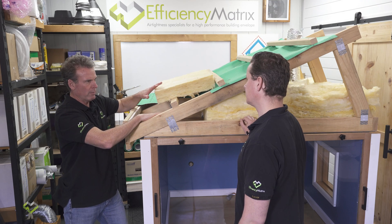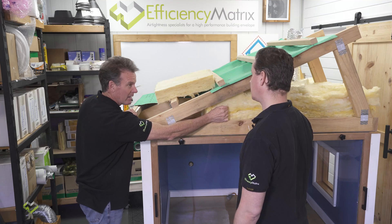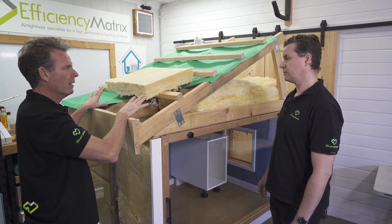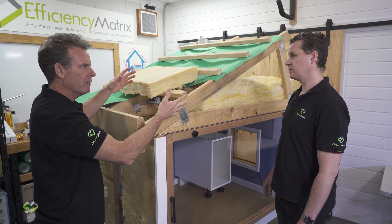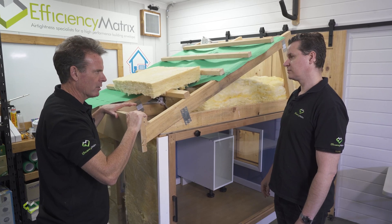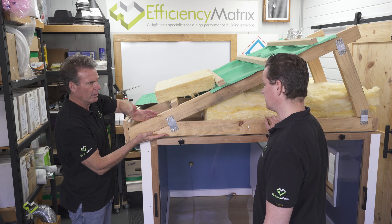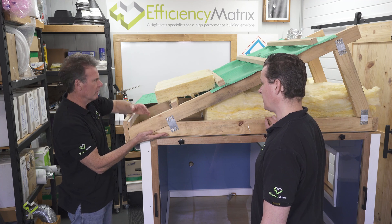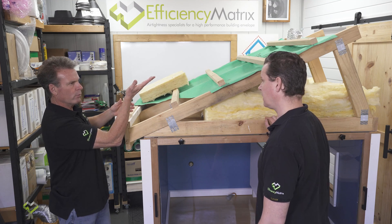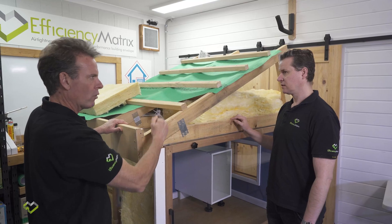When you put a perimeter bat in, you're meant to make up the insulation loss by increasing the height of the main bat. That never made sense to me — why would you put in a poor bat and increase the other bat? That doesn't really make sense. What makes sense to me is that we're building our roofs wrong — this here is not high enough.